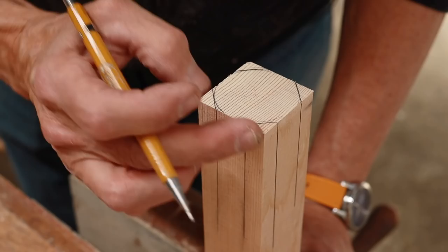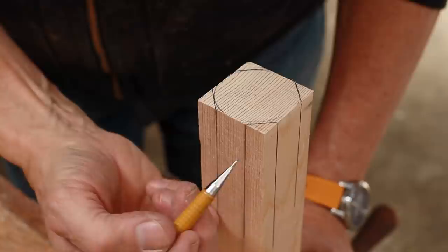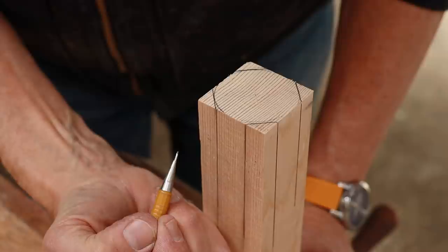With a piece being straight, it's very easy to lay this out on the end and draw those lines down. However, we know that our spar tapers as it gets closer to the fore and aft end. So we want to keep the proportion of these three sections the same. Boat builders that have come before us have figured out that this ratio is 7 to 10 to 7, and because of that we're able to make a spar maker's gauge.